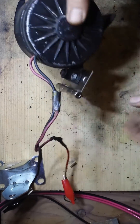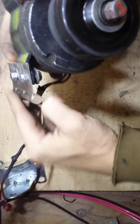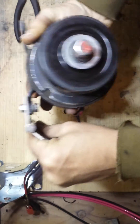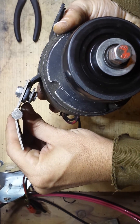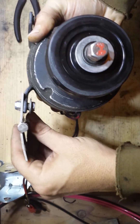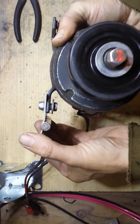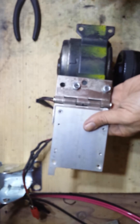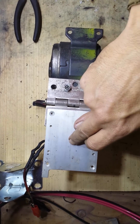Now we have the bracket hooked up. When it rides on the bike wheel, this will be mounted to the bicycle somewhere and will be able to go up and down and rest on the wheel as you're riding. We'll have a spring that tensions it up against the wheel so it doesn't jump off and lose traction — because it's a friction drive, you want to have a little bit of pressure on it. I have another metal plate here that I'm going to use to carve the bracket out of.